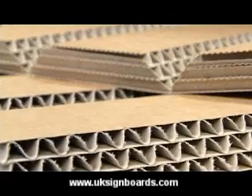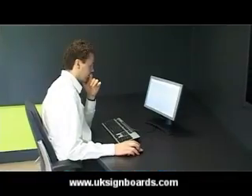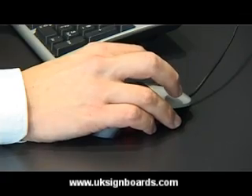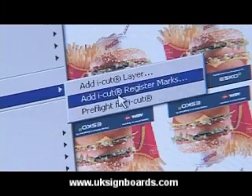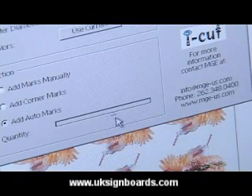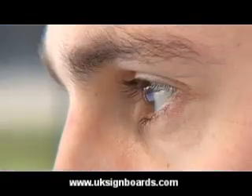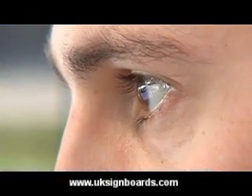Preparing a file for the Kongsberg table is very straightforward. The system works with strategically placed registration marks — dots — that are printed next to the graphics. These dots are used to align the cutting path. Use the Adobe Illustrator plug-in to place registration marks on the file, or do it automatically in the RIP using the iScript component.